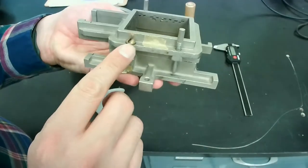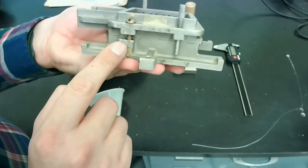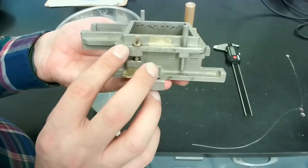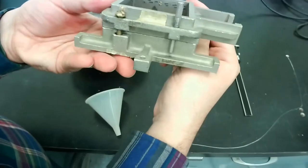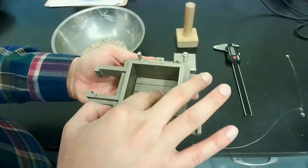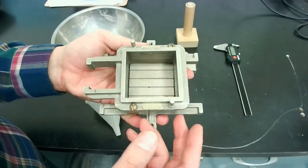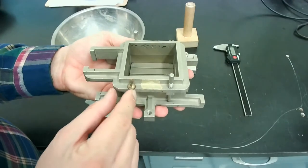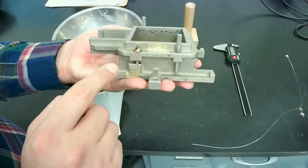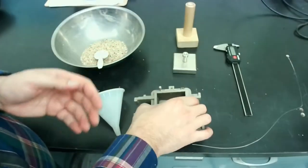You have to make sure at this stage, where we want to prepare the specimen, we have some screws screwing the top plate to the bottom plate. We have it on both sides, so two screws here and two screws on the other side of this. You have to make sure that once we've prepared the sample and we want to start shearing the specimen, to take off these screws, because if we don't, then we'll be measuring the shear resistance of the screws and not the soil. So that definitely needs to come off once we're ready.